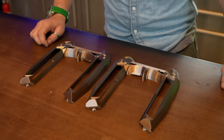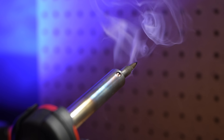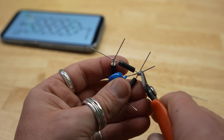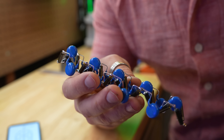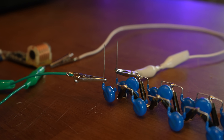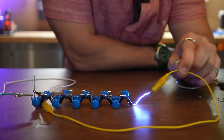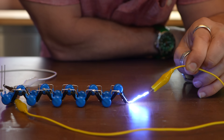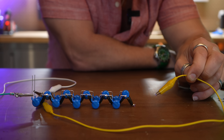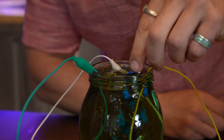Back to the bear taser. I switched to rose gold because it felt more royal, and next up was to design the voltage multipliers. This included specialty high-voltage diodes and capacitors. This is the completed voltage multiplier — my perfectionism took front and center on this one, and it's designed to be really compact. I was certain this circuit would provide more than enough voltage, so I took no delay in testing it, taking the 10 kilovolt supply and attaching it to the input leads. The sparks were juicy, but still not the length I need, so I submerged it in oil to ensure it's properly insulated. This helped a bit.